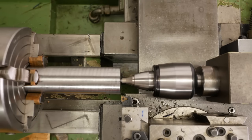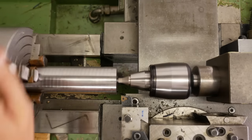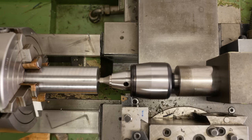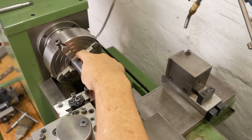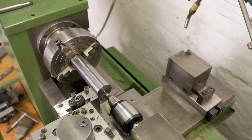The tailstock clamping force is controlled through the pneumatic pressure. Yeah, it was a bit high here. Okay, that wasn't good. I took out the soft jaws because I don't need them yet. Cranked down the jaws a bit tighter and let's see if it works this time. It doesn't push out. M64 P3. Didn't slip this time, that's good.